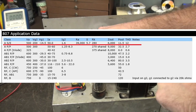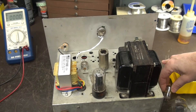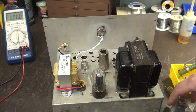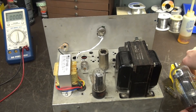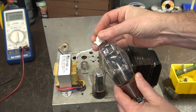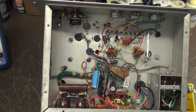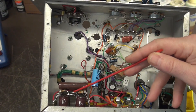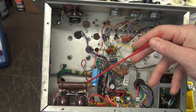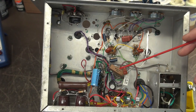The plan is: out comes the 6L6, we're going to remove the 6C4, and the rest of the circuitry stays the way it is. We're going to put in the 807 with its little plate cap, and I'm going to swing the high voltage lead up to the plate cap of the 807. We're going to go with the 7K tap. The power supply is going to change — I'll keep the filter caps, but the voltage divider is going to leave, and I'm going to add some zener diodes to control the screen current for the 807.